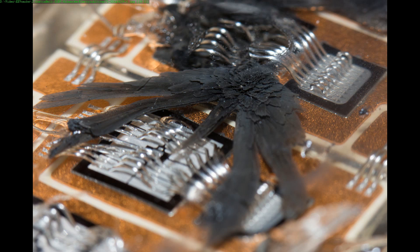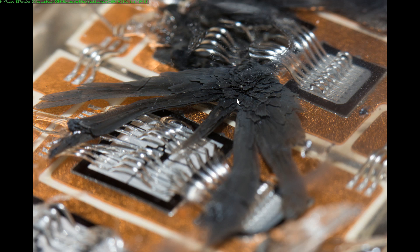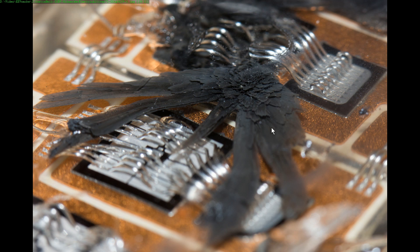And if you thought the last one was beautiful, look at this! This is a stunning, absolutely stunning photo! Thank you very much, Justin Bell, who sent this one in! Once again, it's an IGBT from a Schneider Electric Altivar 71, which is a three-phase synchronous frequency inverter up to 630 kilowatt. And this is the magic smoke actually captured — actually captured inside the gel. These IGBTs are usually exposed dies as you can see there, and you can see the bond wires going over, and it's the top IGBT that's had the magic smoke released and it's been captured inside this gel. That absolutely wins the award for best photo so far! No doubt whatsoever!